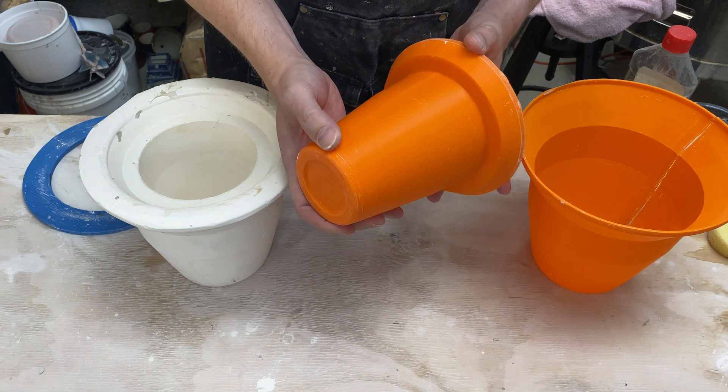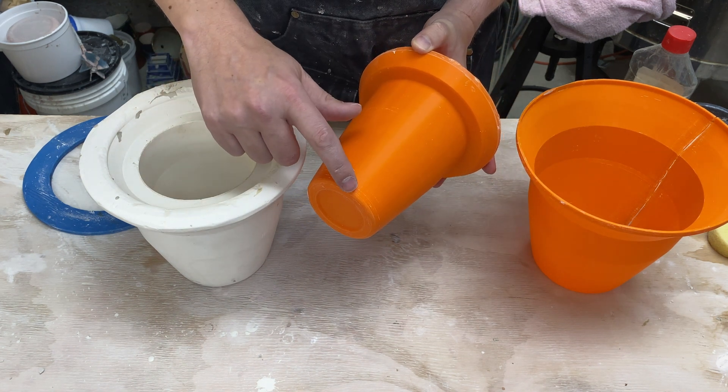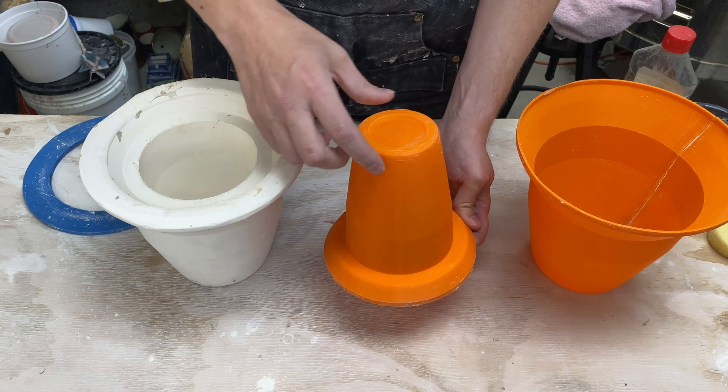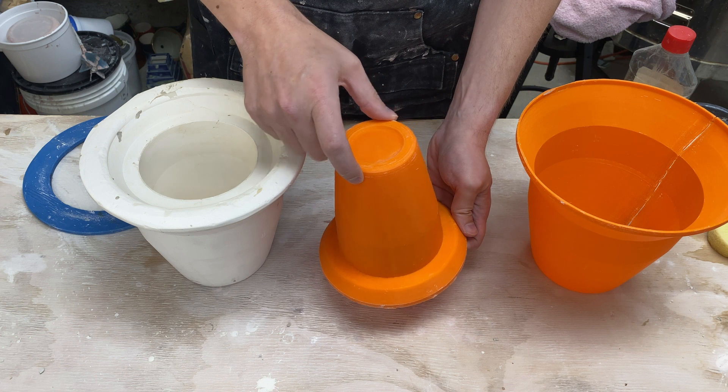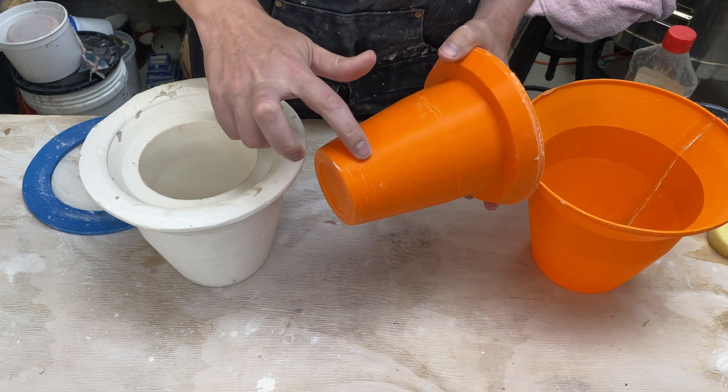So what was going on? Why did it stick? Well, I've cleaned this up but the bottom here is actually less smooth than the top. This printed going up and I'm wondering if the table started wobbling a little bit, so I'm getting a little bit of layer shifts and I can feel a little bit of texture here.